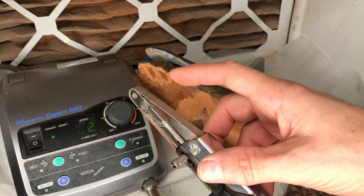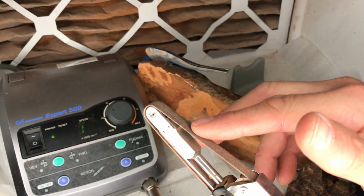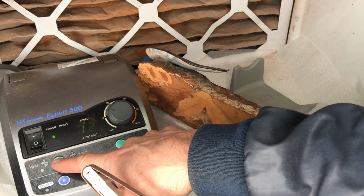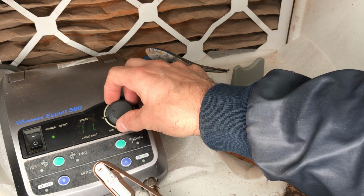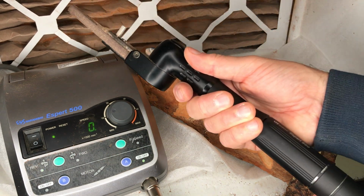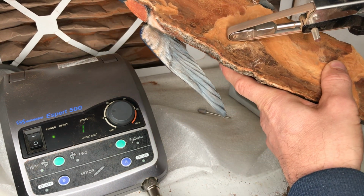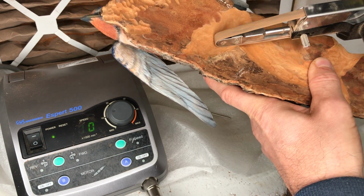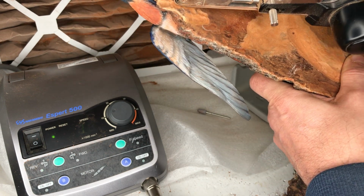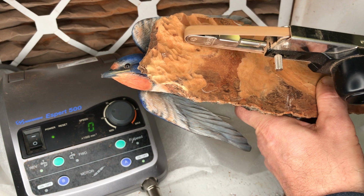You can sand concave areas, hollow areas, with this here, and you can sand convex areas, rounded forms that is, with this part. So I'll demonstrate both. I'm going to put it on reverse speed. I'm going to turn it down low and turn the dust collection system back on. So let's give this a shot here. Turn it on. Yeah, it makes very, very fast sanding. It's easy on the bark. Super cool. That's getting convex areas that are harder to sand than concave.